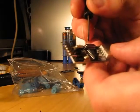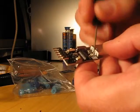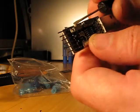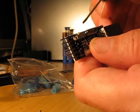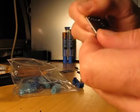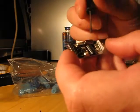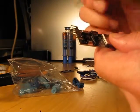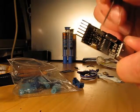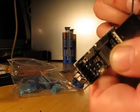Additionally, you have a 12 MHz crystal oscillator, some LEDs, some passive stuff, and a reset switch. This is a neat thing — most of these interfaces or programmers have a 3.3V and 5V switch for logic level. Sometimes you can use this for other applications, not only Arduino. These chips are fairly tolerant, so if it's 3.3V you can feed it 5V and it will be okay. But other devices may require 3.3V, and then instead of building a voltage divider you just flip a simple switch. Then you have a header and of course a USB connector.